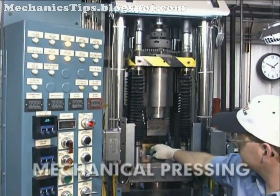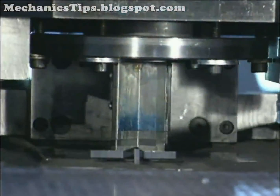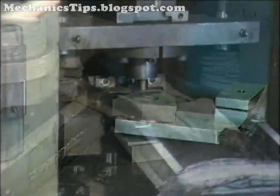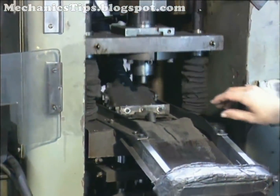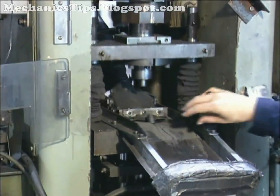Most parts are made by mechanical pressing and sintering. Parts are usually small to moderate in size and can be simple or complex in shape. They can be very thin or thick and can also have one or more levels, shallow or deep holes, and various other details. Parts produced by mechanical pressing can be net or near net in shape and have very close tolerances.